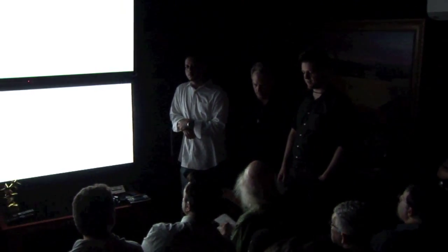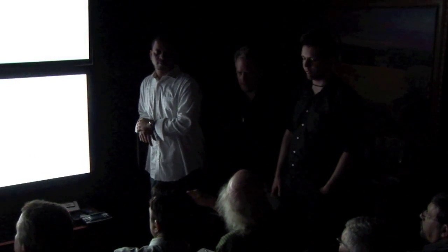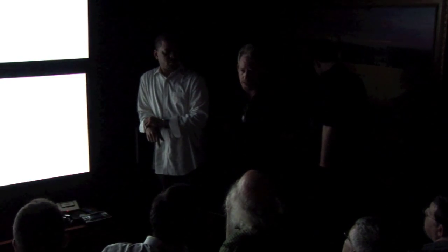Okay, then first time plasma owners often get... Well, yeah, they freak out when they see this because they've heard about the burn-in, which I think is also one of the reasons why a lot of people gravitate to an LCD panel. My customers call me up when they're looking to buy stuff, and I continue to hear, "What about the burn-in?" We need to educate people more thoroughly about the fact that it is not permanent, and it's just what we call retention. So, anyway, back to black.